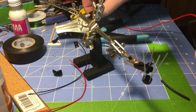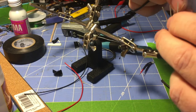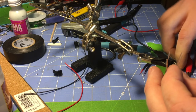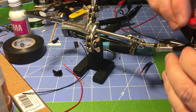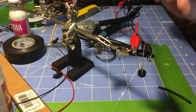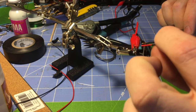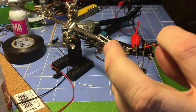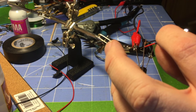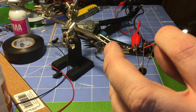While we're waiting for the soldering iron to warm up, I'll show you a little better what I'm talking about. We've got our input power coming in — I'm going to touch it to the two posts. Light on. Change polarity — light on. Change the direction — light on. Every time you see it flash, that's me changing the polarity. That's what the bridge rectifier does.